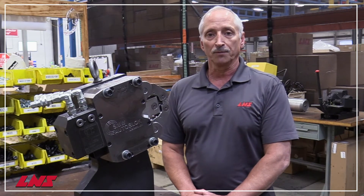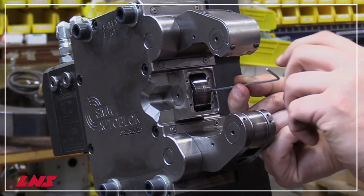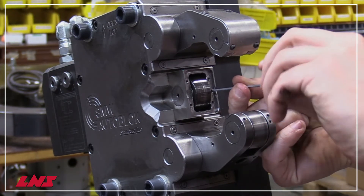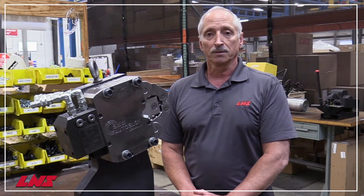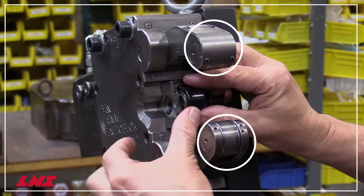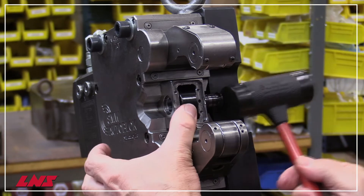The SLU series uses a single straight roller pin for the middle roller bearing that is held in place by a small set screw under the middle roller stripper. This screw needs to be loosened prior to removing the pin. This is a good time to inspect roller pins for damage and replace if necessary. The new roller bearings slide into the slot in the arms and the roller pins are reinserted from each side and screwed together.